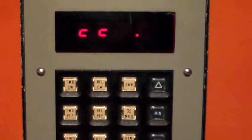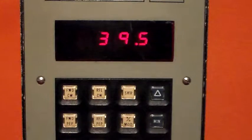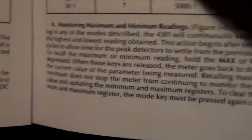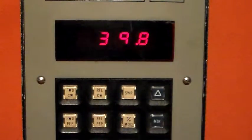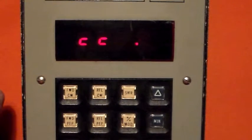Forward dBm: putting it back to FM — there we go. Forward power in dBm on FM: that's 39.8 dBm. Going to the dBm equivalents table in the manual, we had 39.8 — we'll call it 40 dBm — and looking at the table, 40 dBm is 10 watts. Surprise surprise, that's exactly what we're putting into it, so that's pretty good.